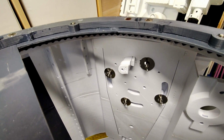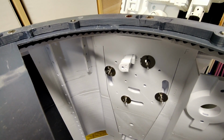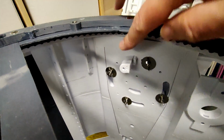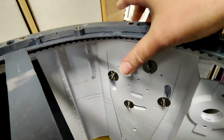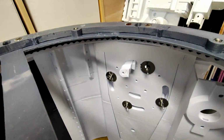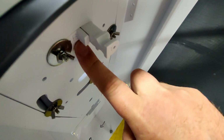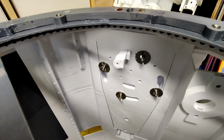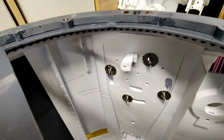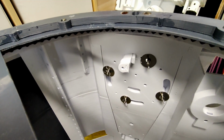And the simple answer to that is the UK MOT process. I am not convinced that just this system, as strong as it is, will fly, because all it takes is for someone to sand this down too much and it'd be quite loose. I mean, let's face it, that was quite loose to go in. Yeah, it came in and out quite easily, so I'm relying on that plug to hold it in. All it takes is a lot of vibrational movement on R2's part, going over cobbles or convention halls or whatever, the little metal strips in the doorways, and it'll start to vibrate loose.